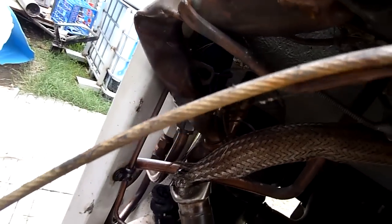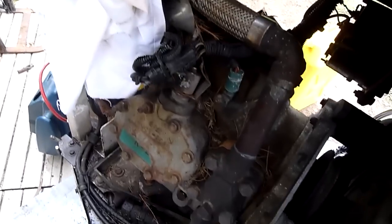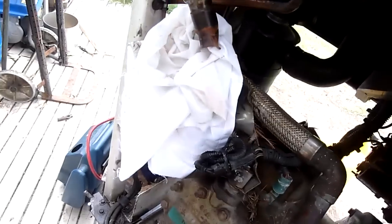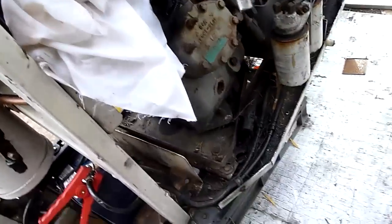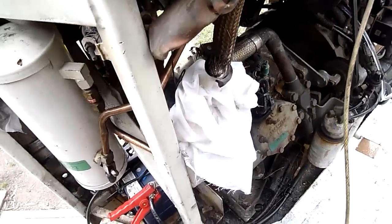But the plumbing's a little bit trashed — the claw just came in and went rip. There was no oil all over it when I found it, so it wasn't charged when it was ripped, otherwise the compressor would have just puked all its oil everywhere. Thankfully it was recovered before it was mangled, but it doesn't help anything. 28 pounds of R22 to recharge it after all the repair work and a new condenser — no thanks. I'll keep an eye out for a complete working one eventually.